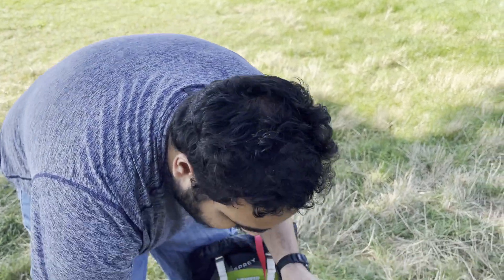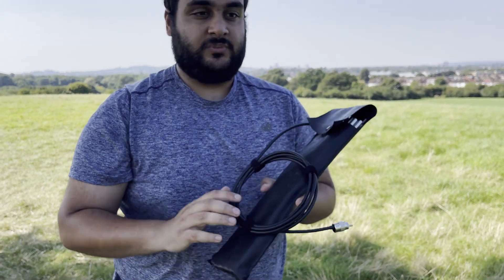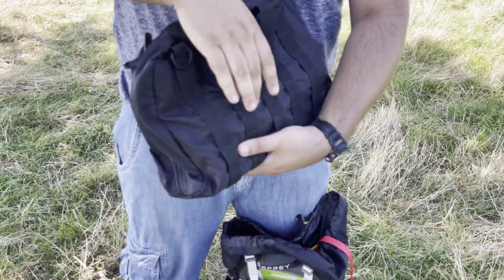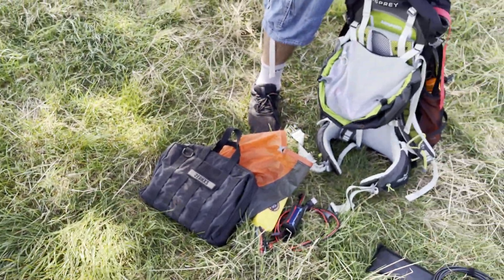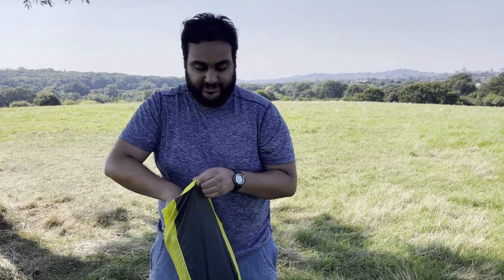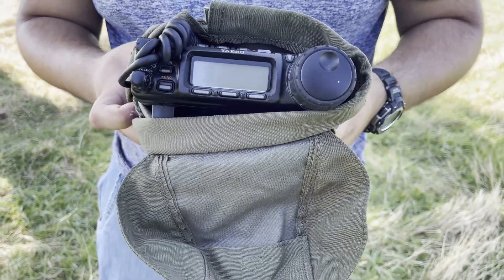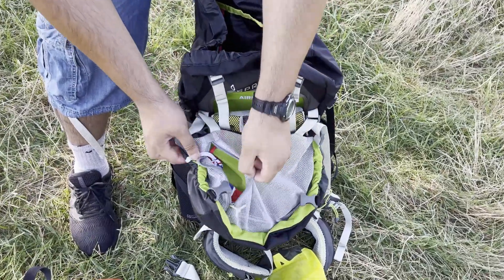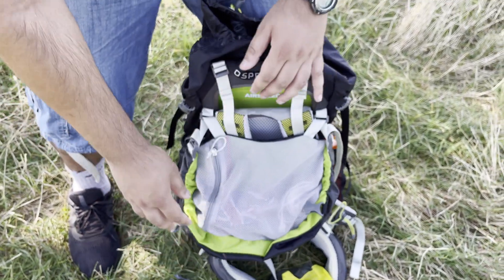There's also a small power meter which shows the voltage and current draw. This is my portable two-meter beam, the HB9CV — very compact. Next in this bag is the Super Antenna MP1, again in a very small bag, which contains everything I need to get on from 40 to 10 meters. Finally, the main radio is the Yaesu FT-857D for HF and two meters portable. In the brain of the backpack I have a sunglasses case, a portable power bank for my phone, and a Swiss Army knife — the most useful thing being the screwdriver.